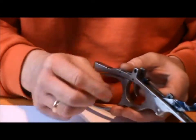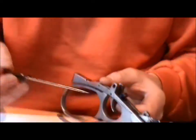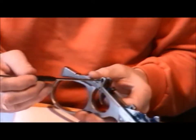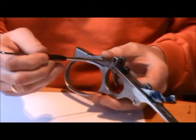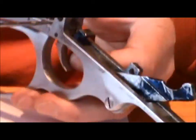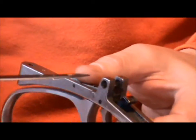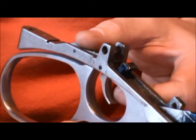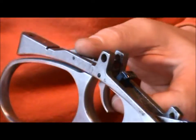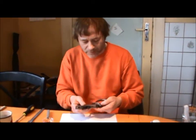If that hole is bigger, make a step in the screw fitting that hole. When it fits that hole, the other hole is smaller and the screw won't go through - hone it up. Don't use a drill bit, you will ruin it for sure. Hone it with a sunnen-style hone with a mandrel that can expand. Someone in your neighborhood will have it. I have a couple - I need them for Harley-Davidson work. But that's another story.